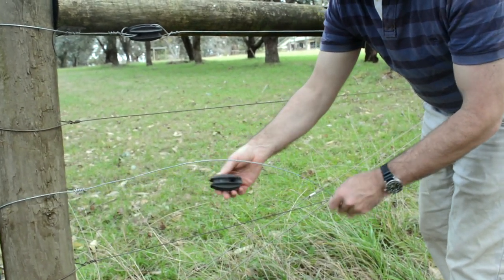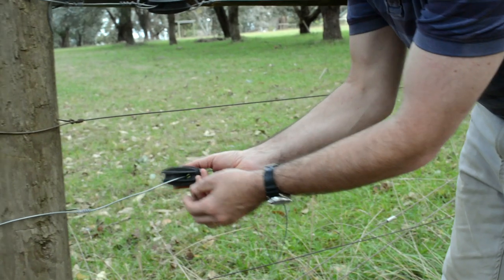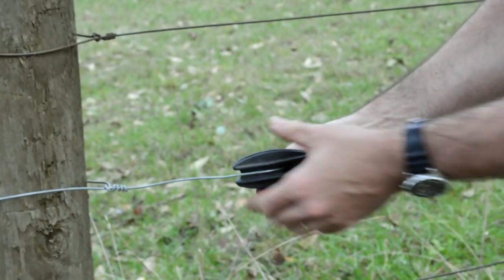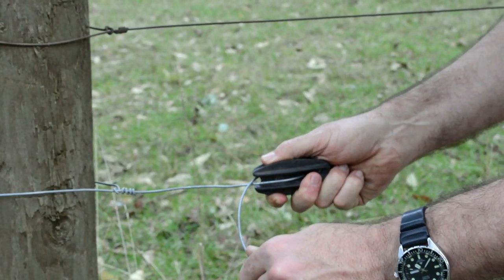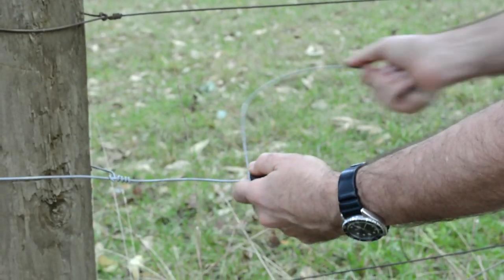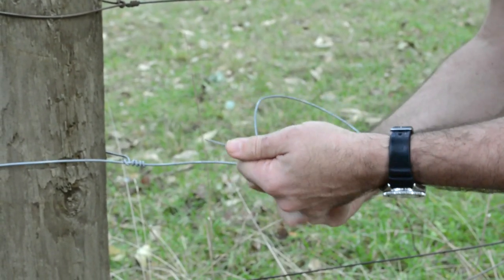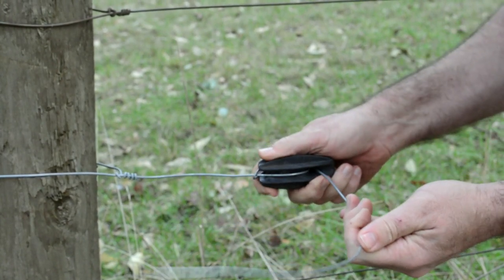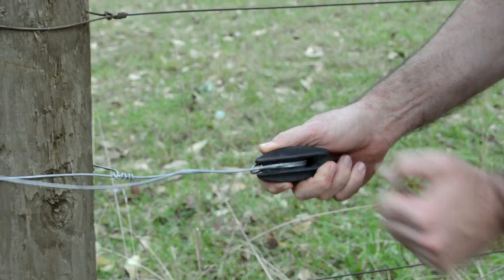What we're going to do is put this meter of wire through the far end of the insulator. You'll notice that most of the insulator is now covered by that wire, and we're going to the far end hole. We then wrap the wire around the insulator completely and make a horseshoe at this point around the wire. Now that we've made that horseshoe, we're going to go back through the same hole again, pulling the wire nice and tight. If you pull wire rapidly you don't get those awkward knots and bends. Pull it down and you'll see we've covered three quarters of the distance of the insulator.